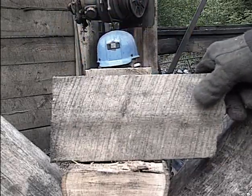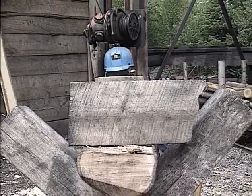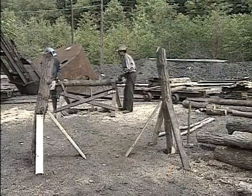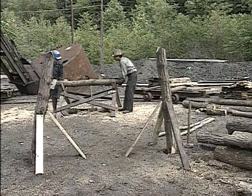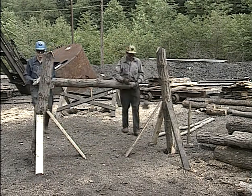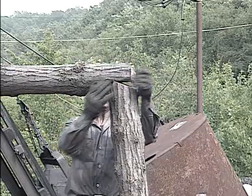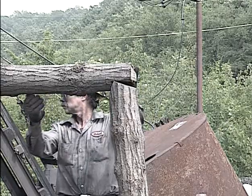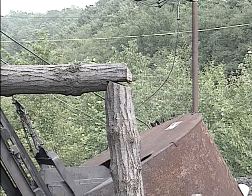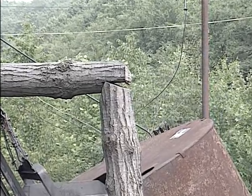Now they're placing a wedge which is cut parallel into both notches to see that both notches are parallel to one another. They're bringing the collar over and setting it on top of the legs. And as you can see, the measurements were accurate and the collar fills the space completely between the two legs. Now you can see a gap at the end of the collar, and this is a deliberate gap.